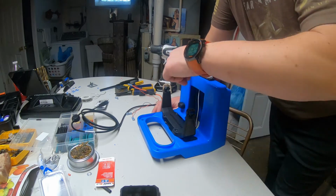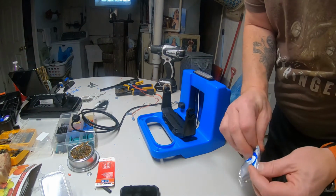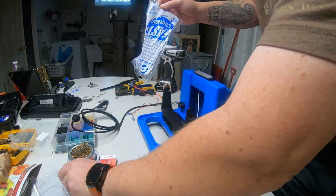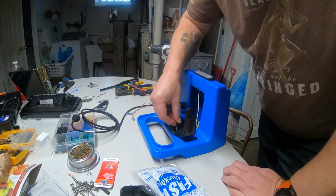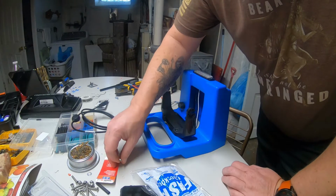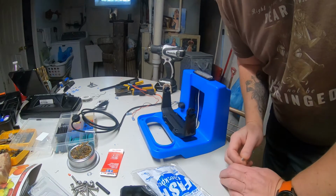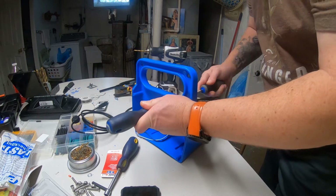then tap the other side. Told you I was using stainless steel. Let's dump all this out here. So, yeah, I got 1.25 inches and 1.5 inches, but 1.25 inches is gonna do it. So let me get this drilled out, correct size. These are 10/24s. Your lock nut on the back.